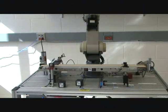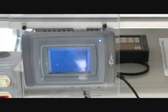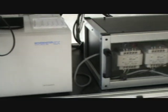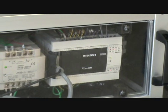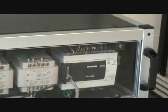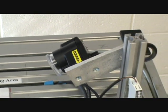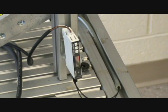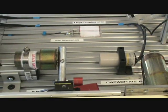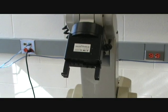Here is our part summary. We have an HMI screen made by Mitsubishi series e1041, a robotic arm controller, two power supplies at 12 and 24 volt, and a Mitsubishi FX 3G PLC. On the right side of the table we have a Cognex vision camera, an eye sensor, and fiber optic that goes to the sensor located on the loading area. Here is a gripper for the arm.